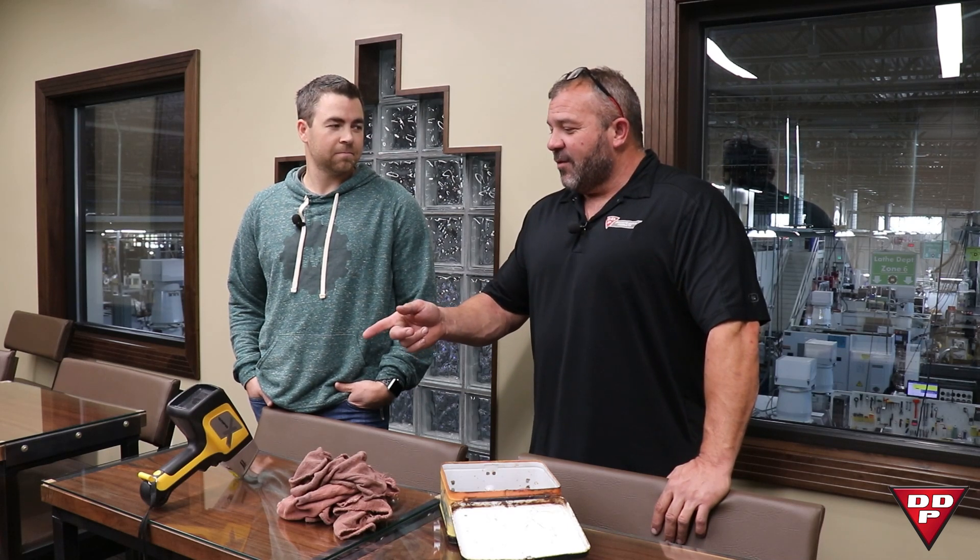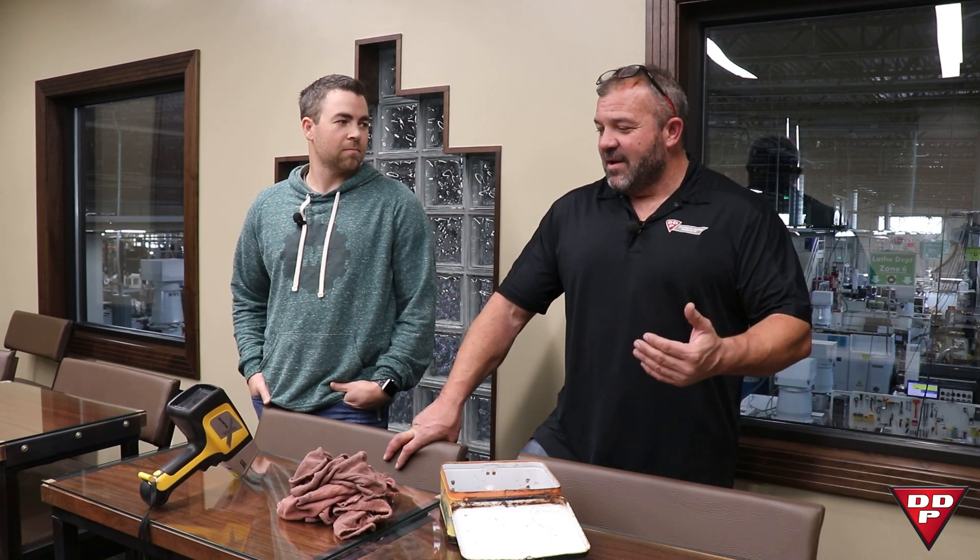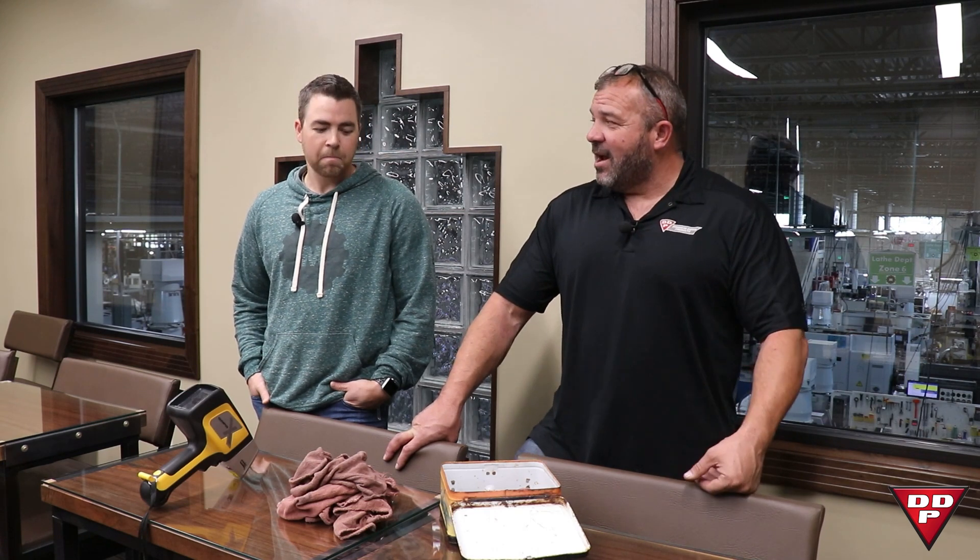One of the things we have to do is make sure that metallurgically we're using the right parts — making the right parts out of the right steels. I was kind of blown away the first time I ever saw that thing. This is an XRF gun, or X-ray fluorescence. It shoots electrons into a material, they bounce back, and it tells you the composition of that material in percentages — percentages of alloys, percentages of anything these parts can be made out of.